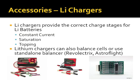Lithium chargers, the 2 that I have on the left, they're available through BuddiPole. They're also available at pretty much every hobby store you go into that has an RC section, by a company called Revolectrix. The one on the left is interesting. It's $165. It will charge any type of lithium battery with any connector on it, but more importantly, it will do detailed charging of lead acid batteries. Another nice thing is this company, for I think a $10 or $15 option, you can get a cable that will let you plug it in via USB and log data out of it. They make bigger chargers also that you can use as basically a programmable DC load if you need that for whatever reason.